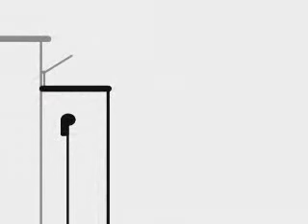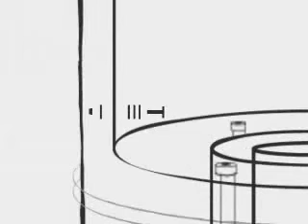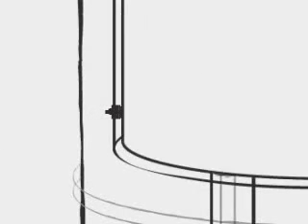Place enough flat washers under the bolt head so that it protrudes the measurement of gap D from the inside of the skirt. Secure these bolts into place. These bolts are used to ensure correct placement of the cooking pot in the stove. They do not go all of the way through to the outer barrel.